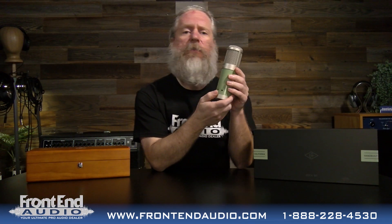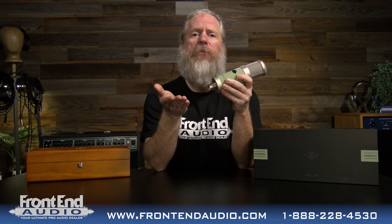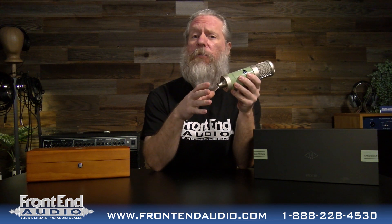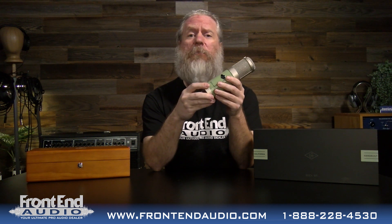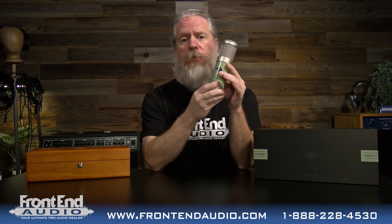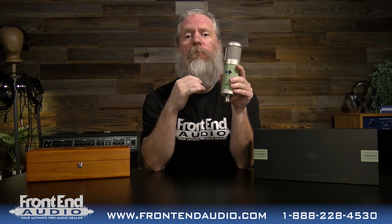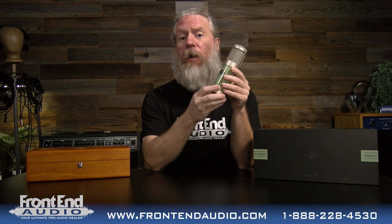Now, with the normal and fat mode, the fat mode gives a nice slight elevation to the low mids and low end to give you a fuller, deeper sound. You might think that's going between a vintage tone in fat and a more modern, brighter tone in normal — and that's simply not the case. Even in normal, this microphone is very musical. I have sibilance issues, and I was able to get virtually right up on the capsule. The top end detail was there, but it was very smooth — not sharp or harsh in any way. This is a very smooth and musical microphone to begin with.